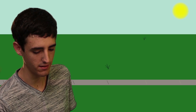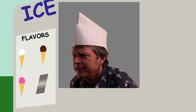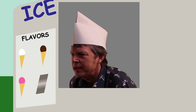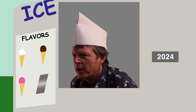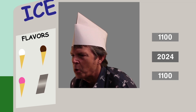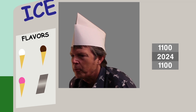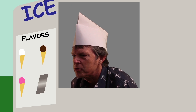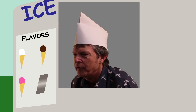Well, how am I supposed to eat this? People don't eat aluminum, duh. Ice cream will rot your teeth. Here's why Alclad's better: Alclad uses strong aluminum — 2024 is the inner core, and pure 1100 series aluminum coats the 2024 to make it corrosion resistant. What you end up with is a sandwich of high strength and corrosion resistant metal. It's the ice cream sandwich of sheet metal. And for an airplane, it's a tasty treat. Use it everywhere — it's a great healthy alternative.